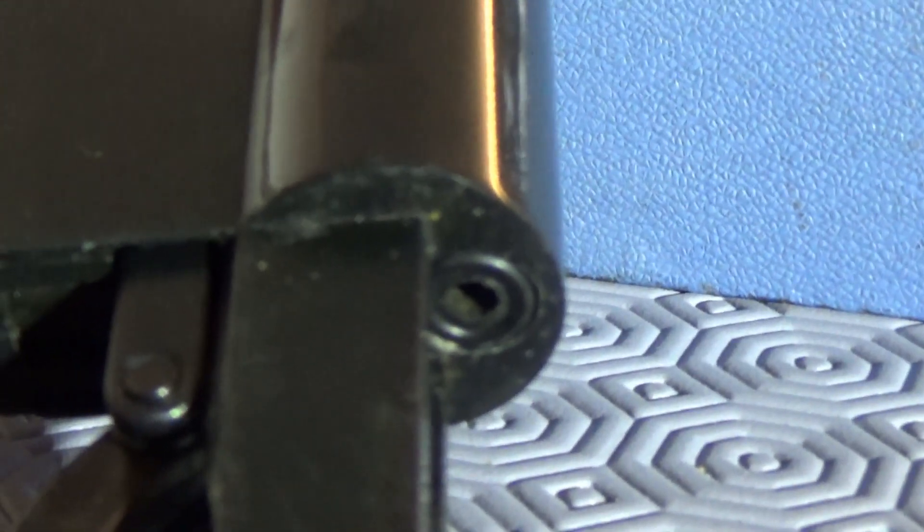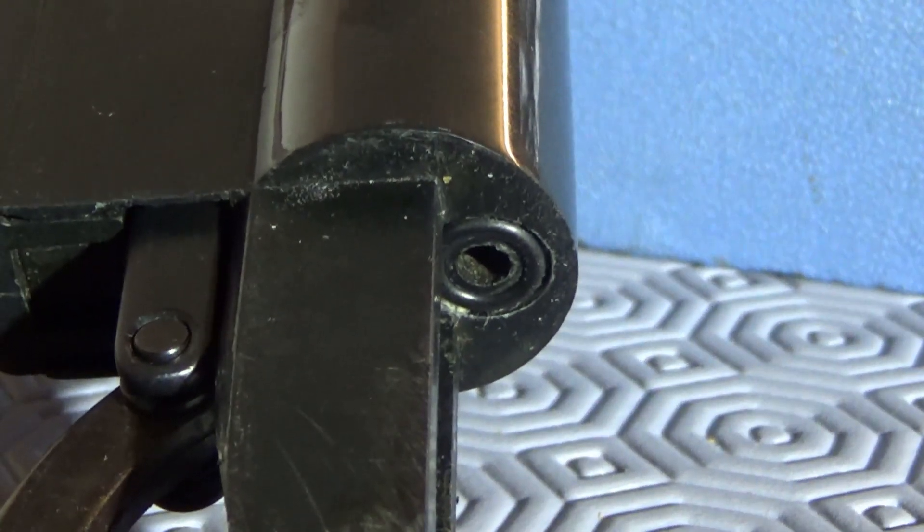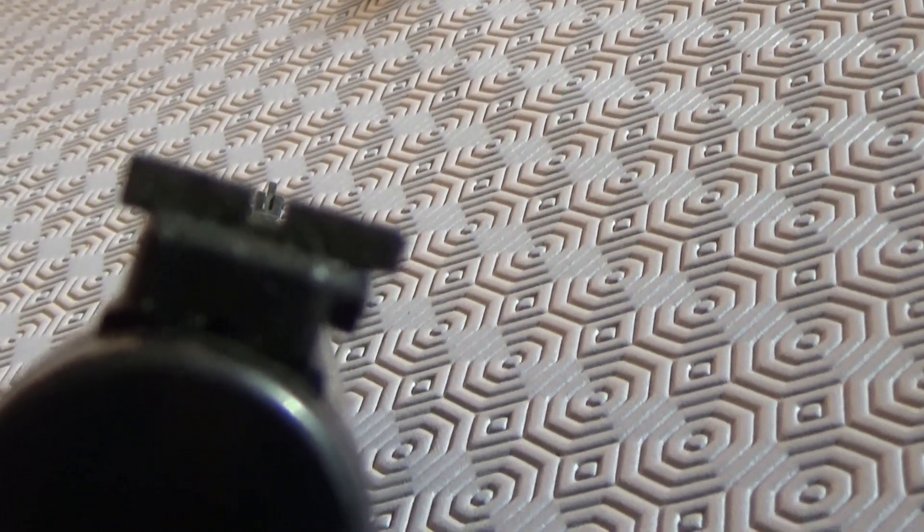The seals were all absolutely destroyed on this gun, so I had to create a new seal for it. I couldn't find anywhere to buy a replacement seal for this particular maker and model of air gun, so what I ended up doing was fabricating my own. I went down to the local plumbing store, went through the washers, and found a washer that roughly fitted it — I had to stretch it a little bit, but that was the only one that would fit. I put that in and it does work — it does seal it, and I can now fire pellets and target shoot with it.